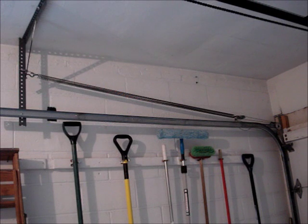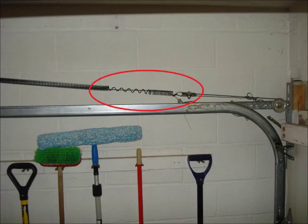I'm going to show how to get the correct extension springs for a garage door. It's likely that you're watching this video because you have a broken spring. Purchasing the correct spring is easy if you're confident that the existing spring is the proper length and weight for the door. This is what happens when a 70-pound spring is put on a 90-pound door.